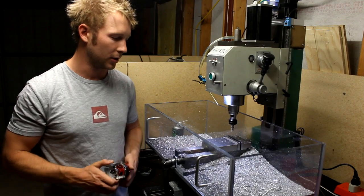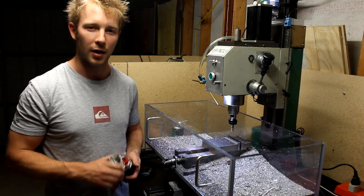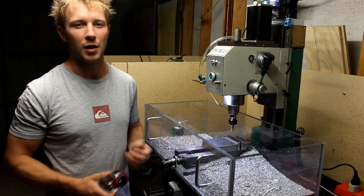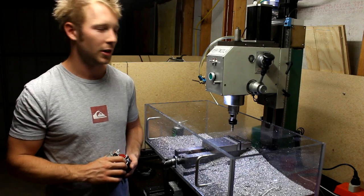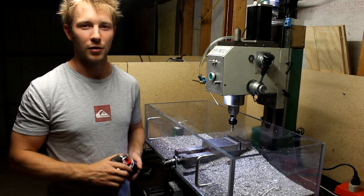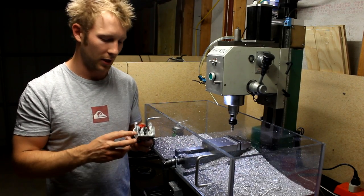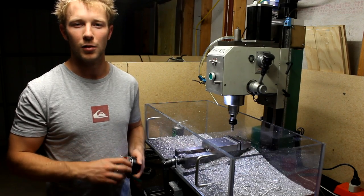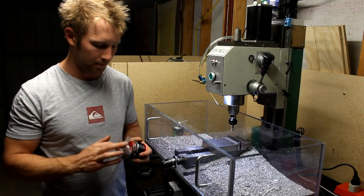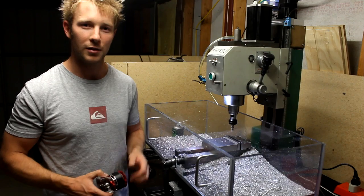I also made a little mount for a GPS on a tail boom as well, so pretty happy with how they came out. But if I could do it again I probably would have designed it for a 10 millimeter end mill. I used a 6 millimeter and had to have it out about 35 millimeters to get into some deep spots, and because the stick-out was so far it wasn't as rigid as it could have been, so I've got some deflection marks — but all in all pretty happy with my first real parts.